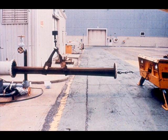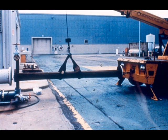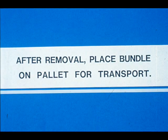Then the bundle can be slowly pulled completely from the shell. In some cases where the bundle is large or extra long, two slings around the bundle are needed to lift it safely. In either situation, make sure the bundle is balanced before removing it completely from the shell. After the bundle is pulled from the shell, it should be placed on a pallet or truck for transporting to a repair shop or moving out of the way.